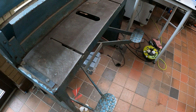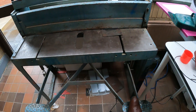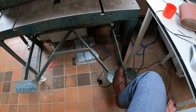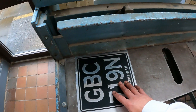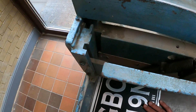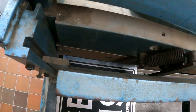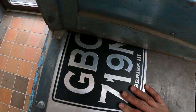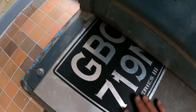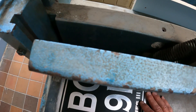The next step is the brake press guillotine. Its simple function is to cut the metal sheets. All you have to do is step on this lever mechanism at the bottom. We just feed through the metal - we're using aluminium as we know. You can see the little guillotine blade at the bottom where my finger is; that goes down and you can line it up with where you want to cut. There is a straight edge here that you can put one straight side of your sheet against, so you know it's going to be square. I'll just line up with this side first of all.